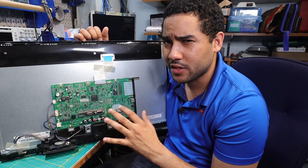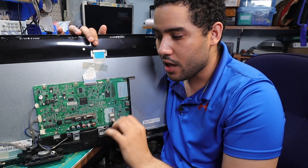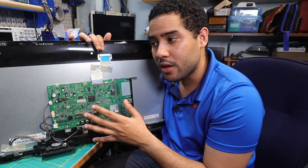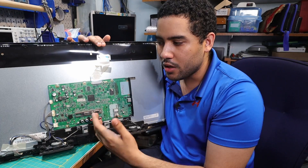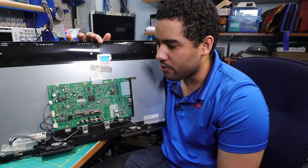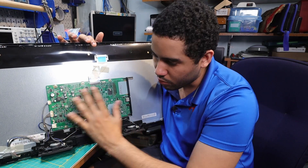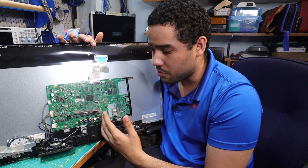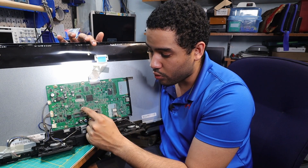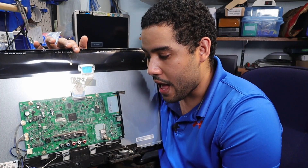This is the dilemma I reached a couple weeks ago when I first opened up this monitor. I used my lab bench power supply to power it — just to eliminate the power supply that came with it — and the current draw for that was about 40 milliamps. Which means things are getting powered on the board. Even if the LCD was bad, the LED light for the bottom here would have still come on. Stuff would have happened even if the LCD wasn't good. That tells me already that this board here is the problem. I looked visually to see if there's anything wrong with any of these capacitors. There's a little bit of rust on the board which scares me because I don't know how deep the rust goes. I looked at all the voltage regulators on the board — what I believe might be the problem is one of these ICs or transistors isn't good. But to be honest, the time it's going to take me to test every single component on this board to figure out what is wrong, I don't think it's worth it.